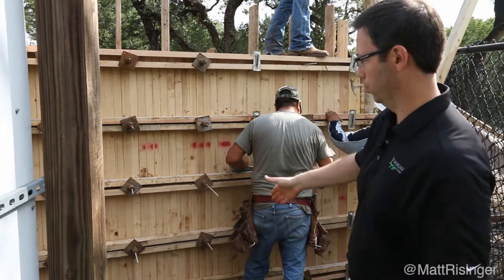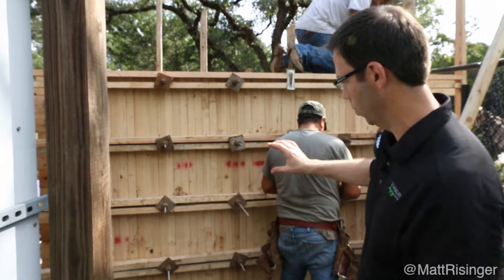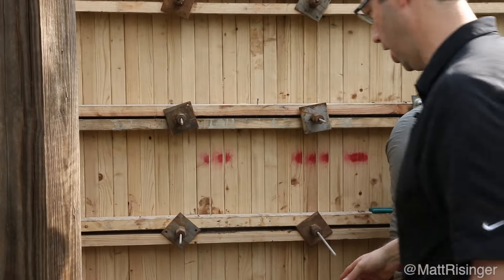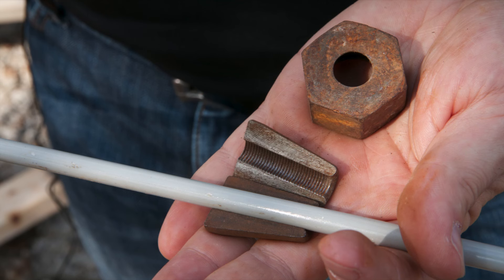On this side we've got the vertical boards — these are actually ripped two-by's; we're going for a two-inch vertical look. You can see how we've had to brace those with some horizontal boards. Again, these are the fiberglass wall ties sticking through here, and these are the wedge anchors that have yet to be tightened up. Once we tighten these up, this is going to lock everything into one solid mass. The concrete mix is very important too — we're using some plasticizers and we'll certainly need to vibrate when we pour.